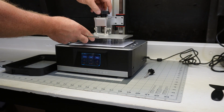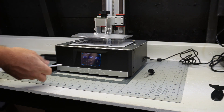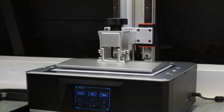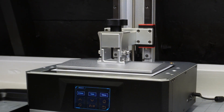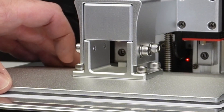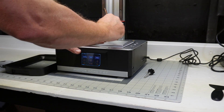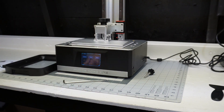Here putting the build plate on — because I have the flex plate on, it's really tight. There's not a lot of room between the Z arm and the build plate. I'll show you in just a second how to put a shim in and fix this because it was a little scary and tight. It also had an issue with a groaning noise when it would come down to home.